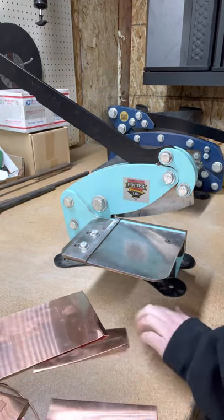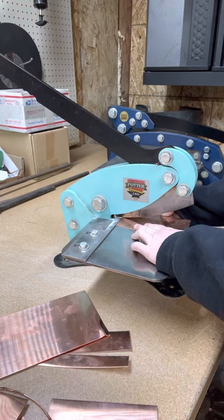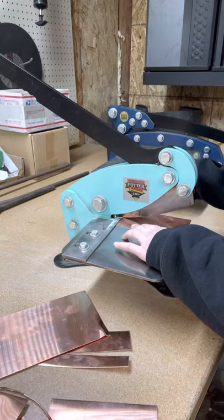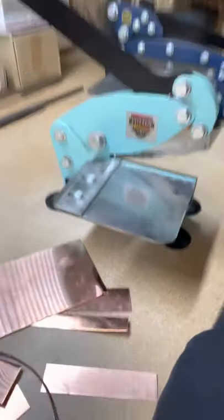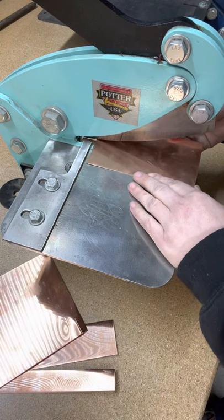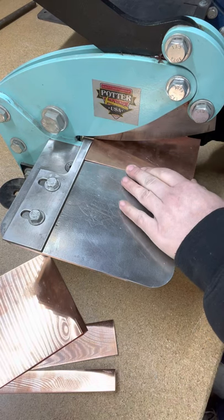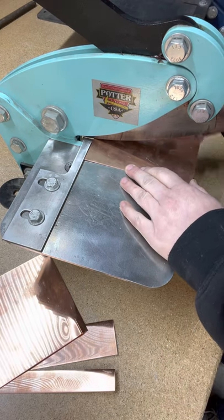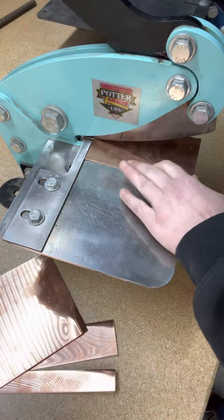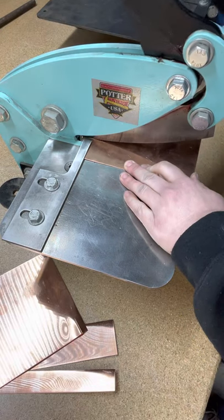Let's say you're trying to make a bracelet blank, about two inches. Same thing - push up against the leveling bar, give it a little wiggle to settle it. Line it up on the very top of the leveling bar, push down, push up towards the leveling bar, and make sure all your fingers and digits are out of the way. Remember that the metal is going to try and shift to the right as you cut.